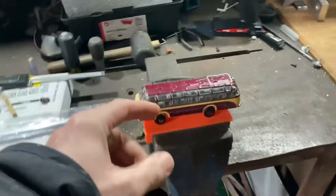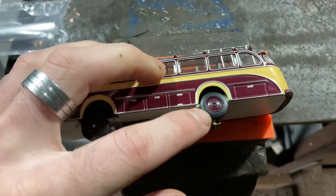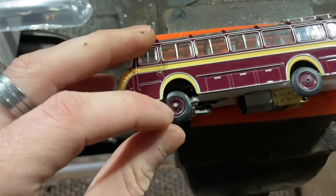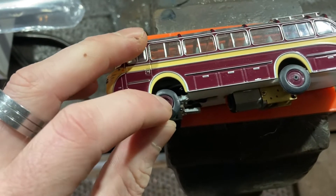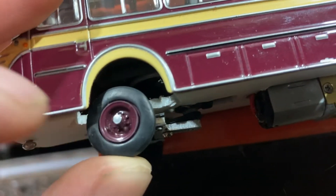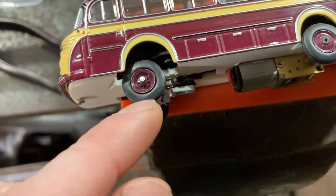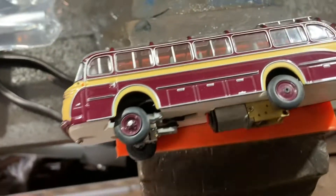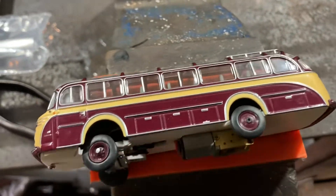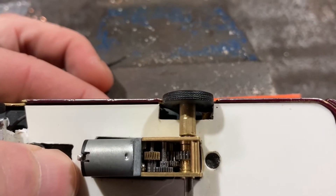Wait — I'm not done with this at all. This is still prototyping stage. I want to make some new wheels, because the tires do come off and the wheels that are on here leave flat spots when you put the tires over them. The flat spot is encouraging the wheels to skid rather than roll. So I've decided I'm going to make some new wheels for this, both front and back.